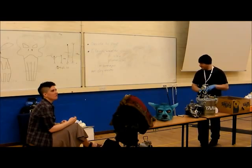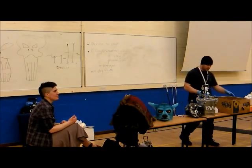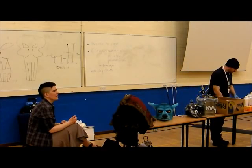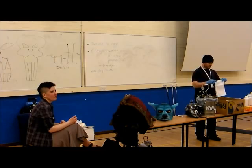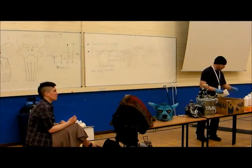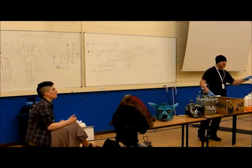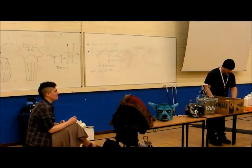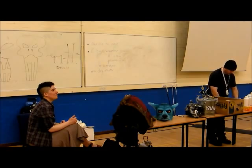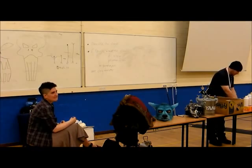The kinds of resin that you can use. Polyurethane resin. These are generally the white resins. They are low odour, reasonably straightforward to use, simple to mix, fairly nice. Polyester resins are the ones that are used with fiberglass and for laminating. They are vicious and will kill you. Then you have things like styrene resins, which are the clear ones. There's various different kinds of clear resins. Basically, my rule of thumb is anything other than polyurethane resin, overdress.